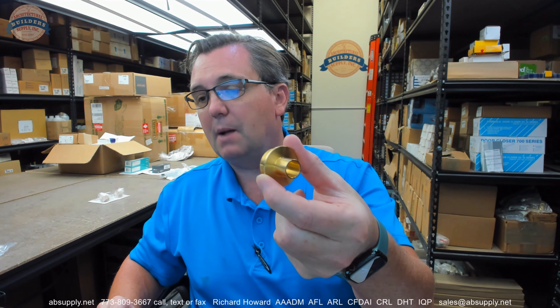It dawned on me — there's guidance in terms of what guide you must screw into the base of your router. And that's true whether it's a Porter Cable hinge butt template kit, a Templaco template for doing a lock, or Soss doing Soss hinges if you buy their template. Everyone's template has to have a guide that goes with it. So that's what this is used for.